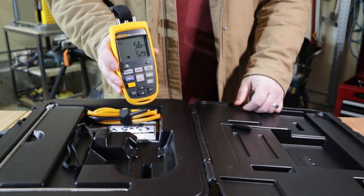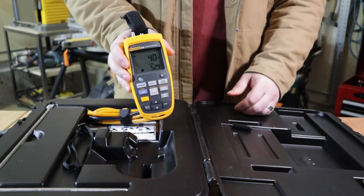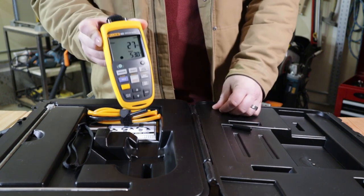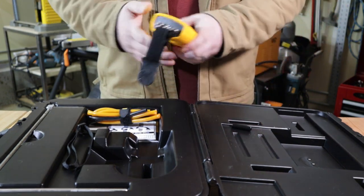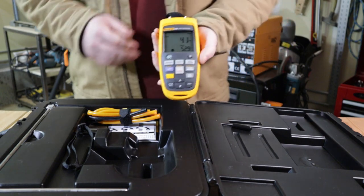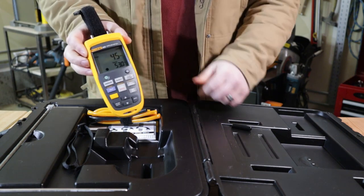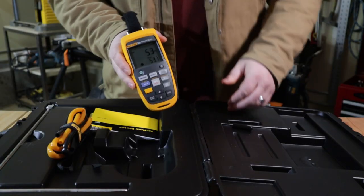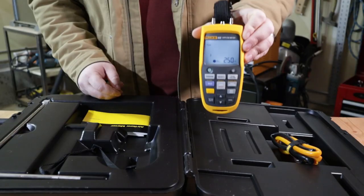This is an extremely valuable tool for any HVAC technician — pressure, velocity, and airflow all in one. You can measure ventilation compared to the loads needed for occupancy. It calculates CFM readings from 0 to 99,999. The operating temperature range is 32°F to 122°F (0°C to 50°C). Battery life is rated at 280 hours with backlight off and up to 60 hours with backlight on. It stores 99 samples in each of its three modes and does min, max, and average.